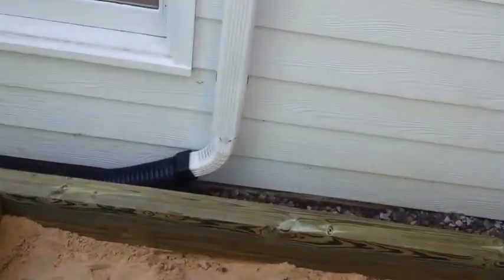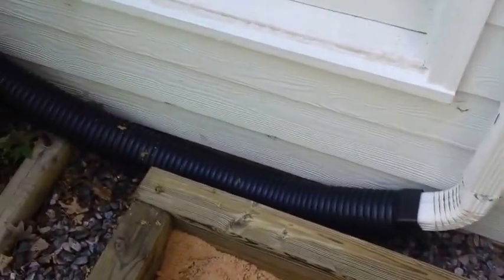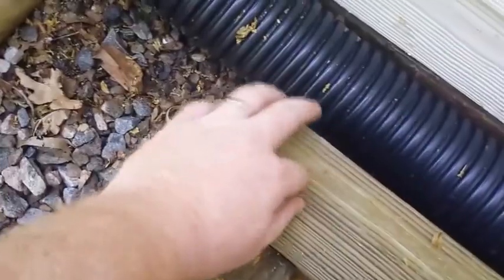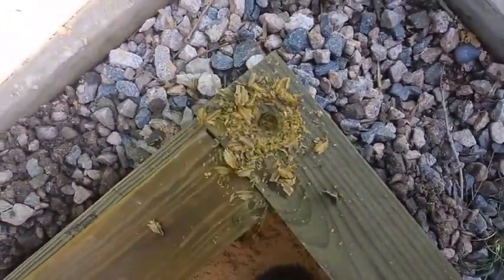So this went all the way over. We had to do some quick adjustments to the downspout for the water thing. So all the way over to here, put some lag bolts. We're going to counter set them, so this one will be on this guy, and then we put them all the way over to this one. So each next layer will have one screw on one side, and then the other one will screw into it from the top as we go up, and we're going to go up 6. So 6 high on all ends. And then there you go. We had to clear out all this gravel, so gravel all the way around. Ta-da.